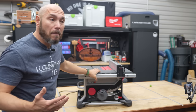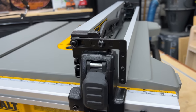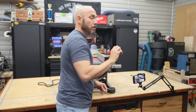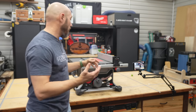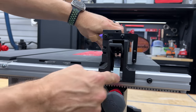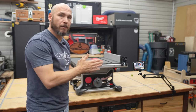What do I like about the SawStop compact jobsite table saw? I love the fence if it's dialed in. What I really like is the rack and pinion — the DeWalt jobsite saws and several other models have rack and pinion fences also, but essentially it means it's gear driven. There's a rod that connects both the back and the front gears, so when you're turning it, the back and the front are moving exactly the same, keeping the fence nice and square to the miter slot and the blade. It's also very easy to adjust the fence to square it up to the miter slot.